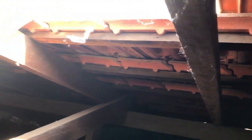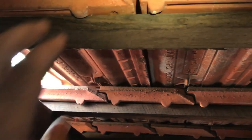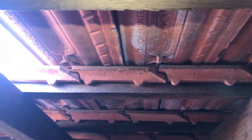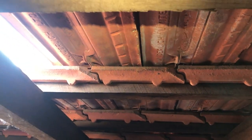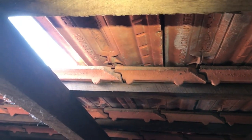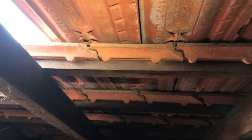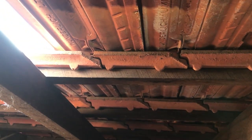I've just climbed in here into this terracotta tile roof and I've got the hose up here and I'm about ready to start insulating it. Now, terracotta tiles aren't the same as concrete tiles — these are clay tiles and they don't come out the same way. When we're finished I might show you how they come out, but they're a bit specialized. A lot of guys try and kick them up, in which case you'll break them.